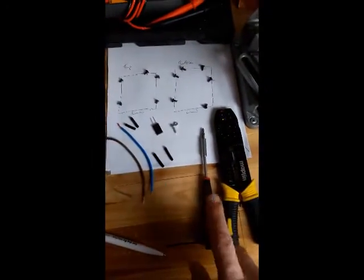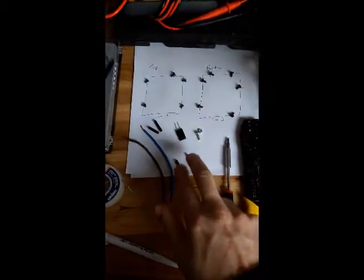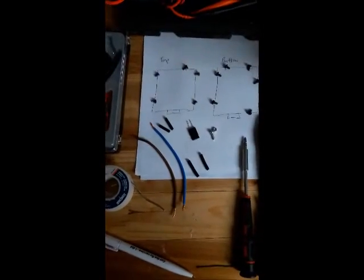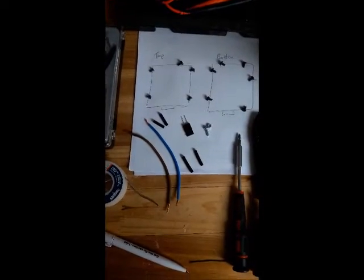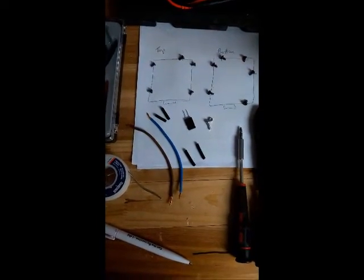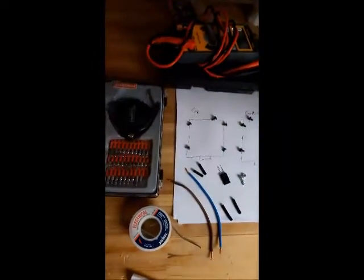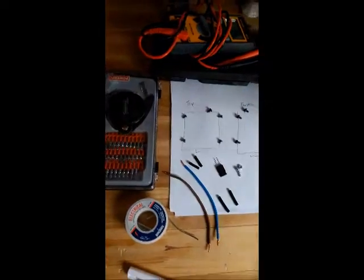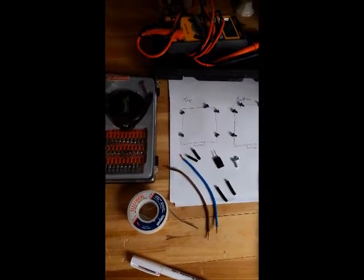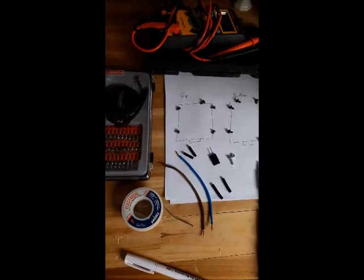You'll need wire snips, wire strippers, and a screwdriver with the appropriate Phillips heads to take the casings off the board, some heat shrink tubing to cover up the joints at the end — reflecting on the document, why take the chance of anything coming into contact with exposed wire — and obviously solder and a soldering iron. I used the multimeter already and checked the resistance across both resistors; they're in and around 9.2, so should be good to go.